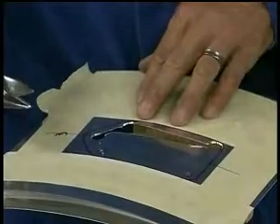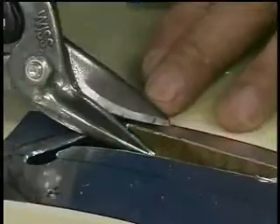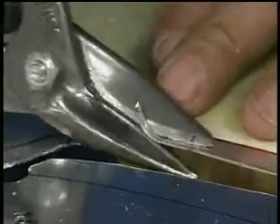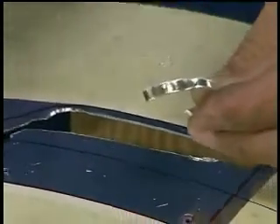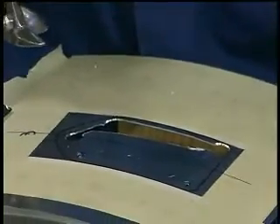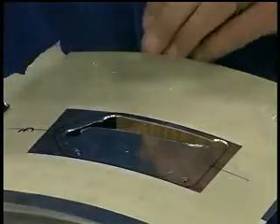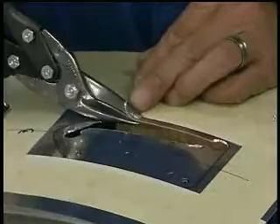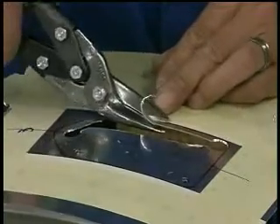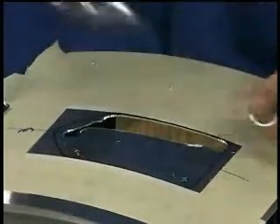I stayed a fair distance away from the line, which is good, but you can see there's a fair bit of distortion. So I'm going to come closer — about half that distance — taking as little a strip of material as possible. If you try to take too much at once, it causes more distortion to the aluminum, so you want to take a little bit at a time. Now I'm going to cut very close to the red line, almost right on the edge of it.